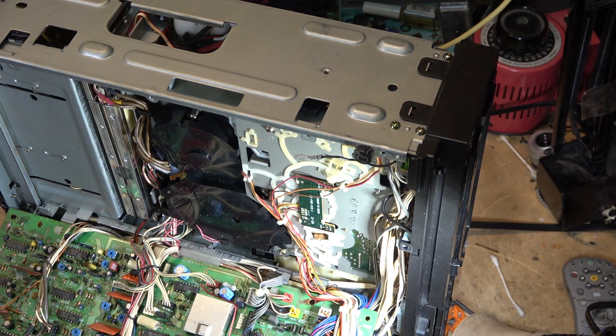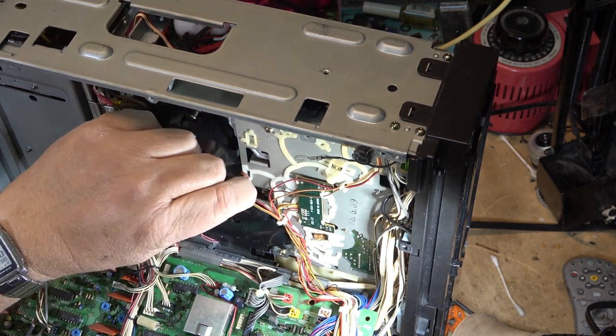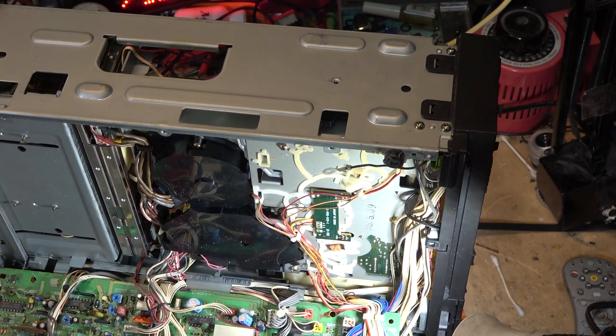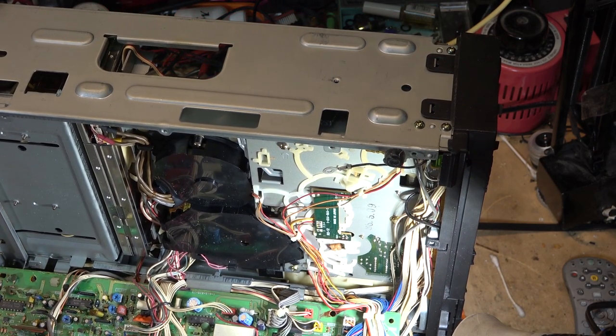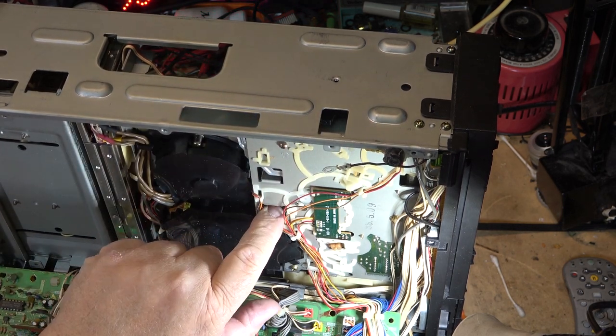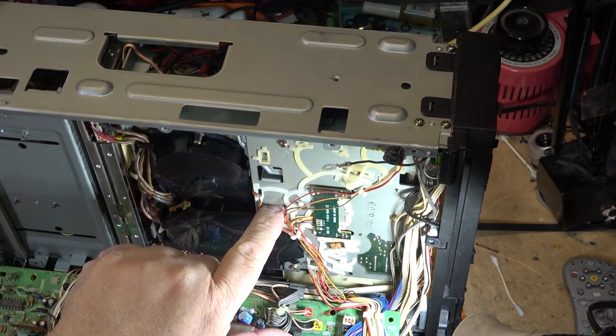More than likely, that's what's wrong. And there's a thermal cutout on this solenoid here that's not clicking in. Didn't see anything when I did that, did I? Did I see any movement of that solenoid when I unplugged it? You see, the other solenoids are working. This one's not pulling in. This is what releases the back tension brake.